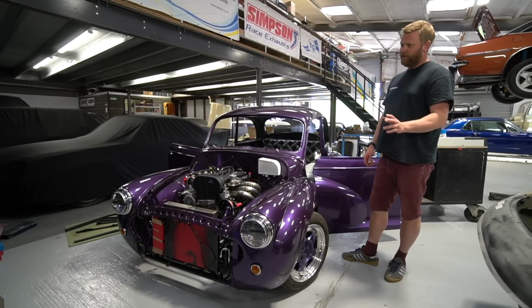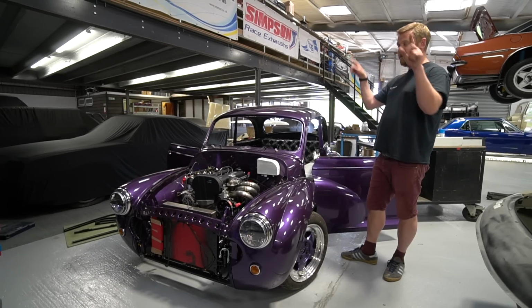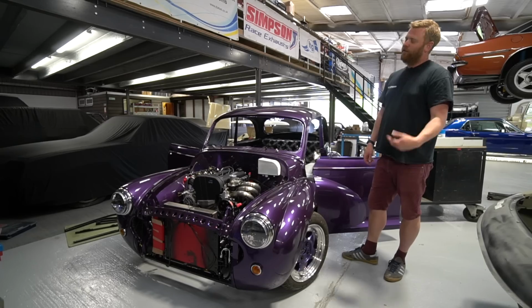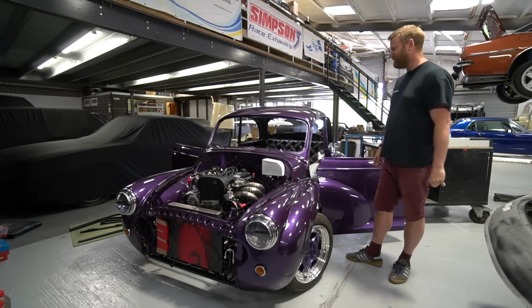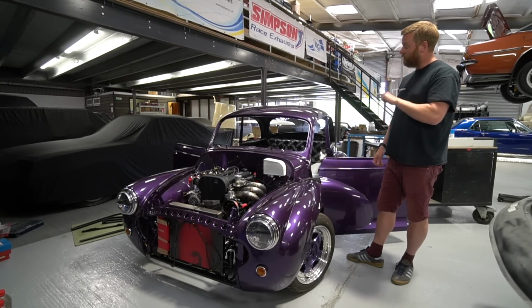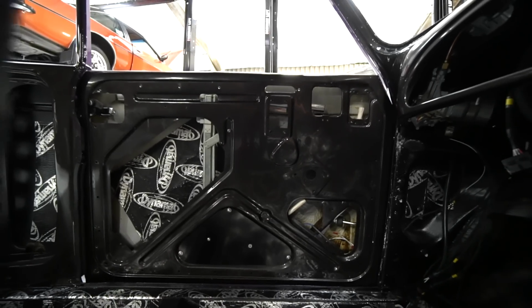I think the current solution Dean's been working with is doing a thin layer of foam over the top with holes around the clips, and then another layer of foam over that without the holes. But then that runs the risk of being able to see inward dimples where they are, especially if you end up pushing hard against the card. So we came up with an idea to try for the first time on this one, which is actually to do the door card itself as 2 laminated layers.